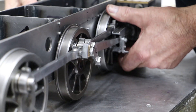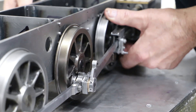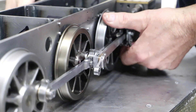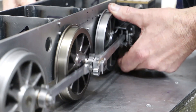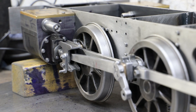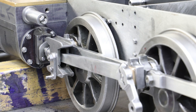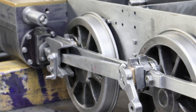There is still a tight spot in the rotation of the wheels, and I'm thinking that's probably down to a slightly bowed coupling rod. It was a bit of a pain to make two sets of connecting rods, but let's face it, they're not the only parts that I have or that I'm going to have to make twice. I do think it was well worth the effort, and this collection of rods around the driving crank pins looks so much better.